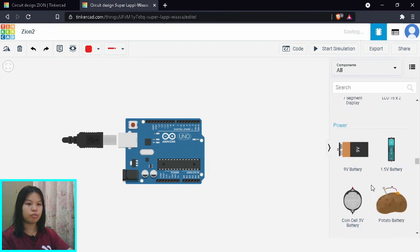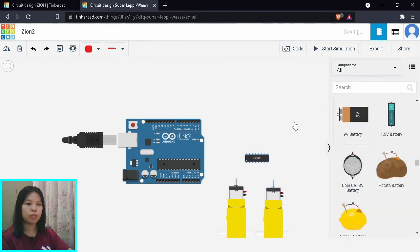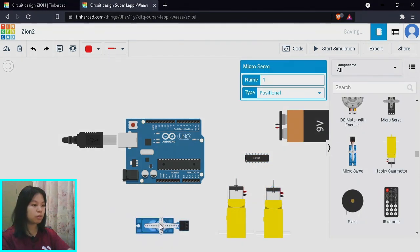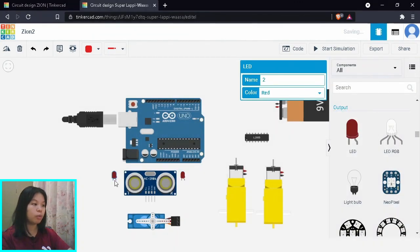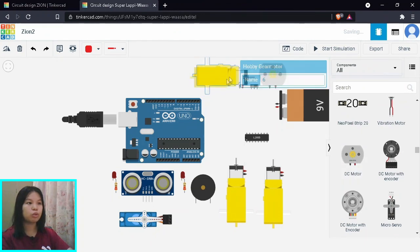For our driving module wiring, we're going to use an Arduino Uno, two DC geared motors, and one motor driver L293D. I'm only using one motor driver. I'm also powering the motors with an external 9V battery so there's enough power to rotate. For obstacle avoidance, I'll use one servo and one ultrasonic sensor HC-SR04. Indicators are LEDs powered with 280-ohm resistors, and one buzzer. For the cleaning module, I'll use one slider switch, one DC motor, and one DC geared motor.